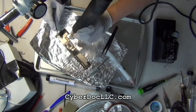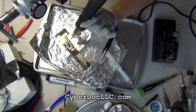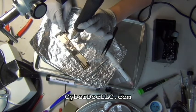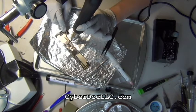I already removed the filter using the soldering iron and just put a new one on with some flux residue on it. Now I'm working on the microscope and using my heat gun at low air speed. You don't want to use high air speed — you want minimal air speed. My temperature is either set at 150 or 200 degrees Celsius for this repair; I'll set it at 200 just to speed things up a little bit. When you use the hot air gun, you don't need to worry about damaging anything at 200 degrees Celsius.